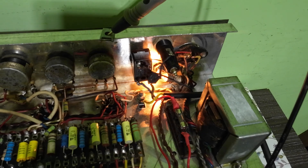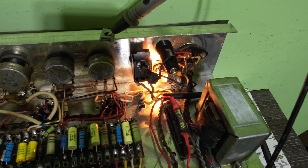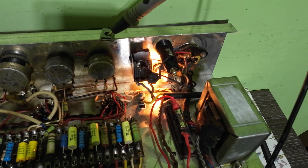If you've got one of these amps and you're using it on a gig and suddenly the sound goes but the pilot light's still on, turn the amp off straight away. Don't spend time looking through your leads and effects — just turn the amp off. Because if the filament winding has gone open, that voltage will crawl up and up until it reaches 850 volts as we saw in the video, and the caps won't be in very good shape after that. If you're testing your leads and effects for three or four minutes, those caps have been cooking — they've not had current on them, but they've had the voltage.